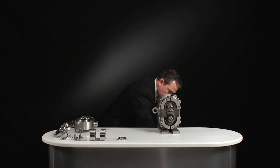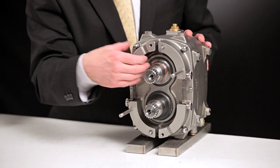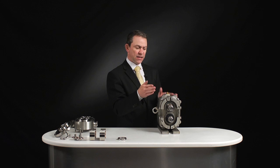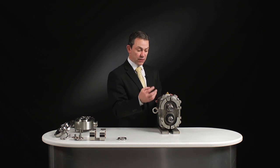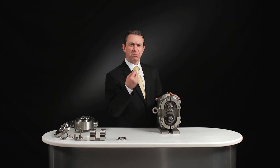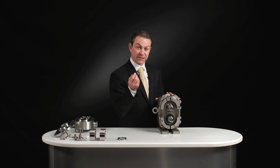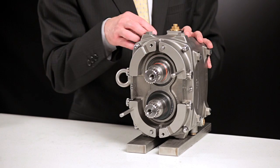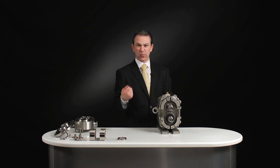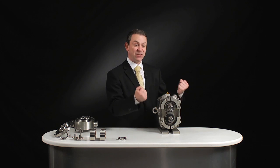Another feature on this pump is that we're not using lip seal designs on the gearbox — we're using labyrinth seals. The labyrinth seal has a convoluted path and two faces like a mechanical seal, which means much more longevity. Oil doesn't get out, and at the same time product can't get in. We even have a labyrinth seal on the back to stop high-pressure hose water from entering the oil, making it much more robust.